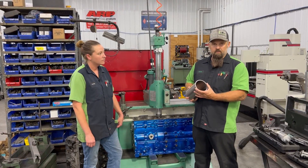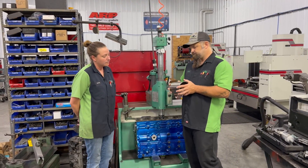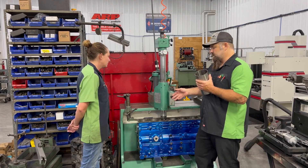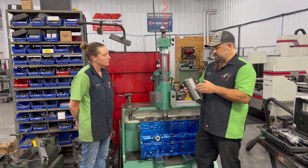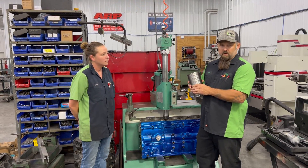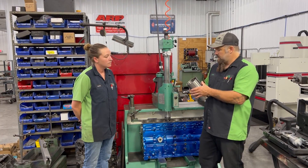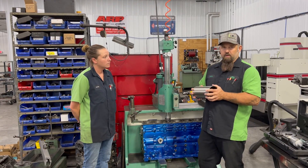The OD of your top flange is very important — something you think about ahead of time. We're going to run through the basic operation. We've got it in our boring bar, everything's set up to go in the first hole. First, we've already measured the OD of all of our sleeves. You always want to check them on top by the flange and make sure they're round. We're going to leave them with one to one and a half thousandths press fit.